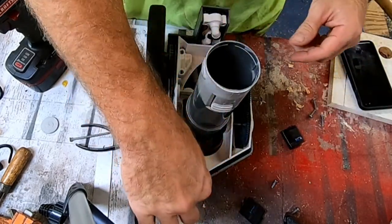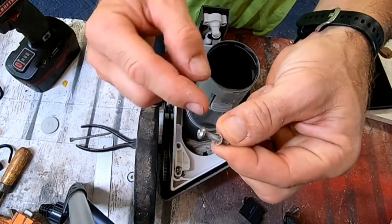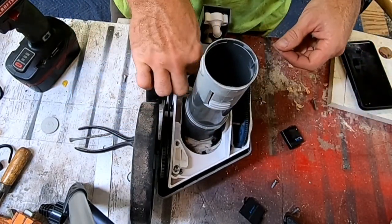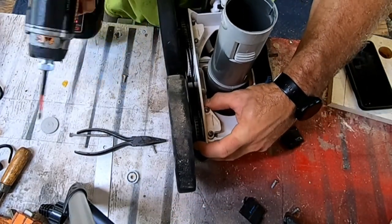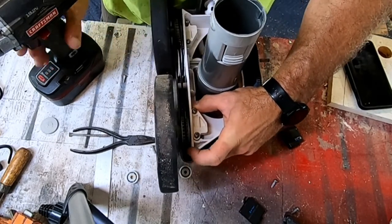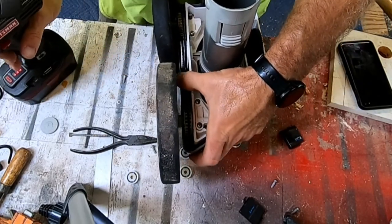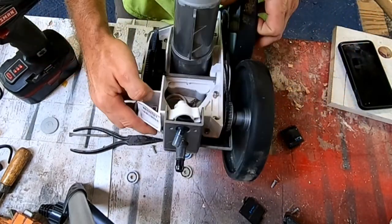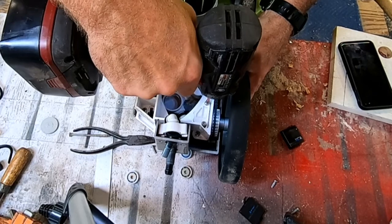Now you've got everything inside and lined up — let's cinch down our wheel hubs. Most of these screws should have a little washer on them; make sure you have those on there. This has a little bit of play, so you want to put a little tension on the belt — just push it forward with your finger and tighten it up. You don't want too much tension but you want some: if you don't have enough, it falls off; if you have too much, it breaks. Do the same thing to the back.